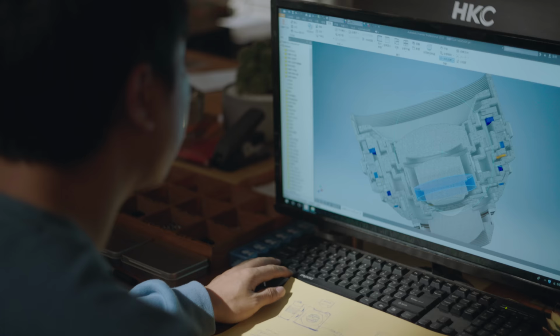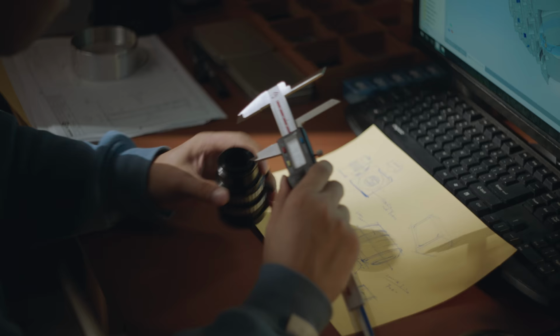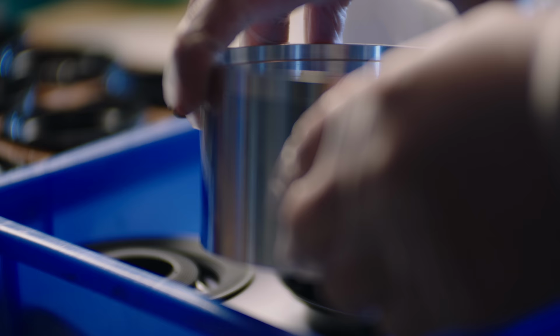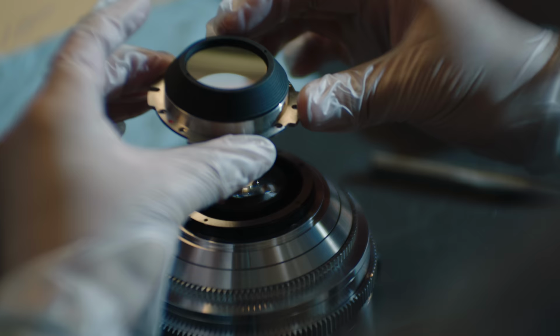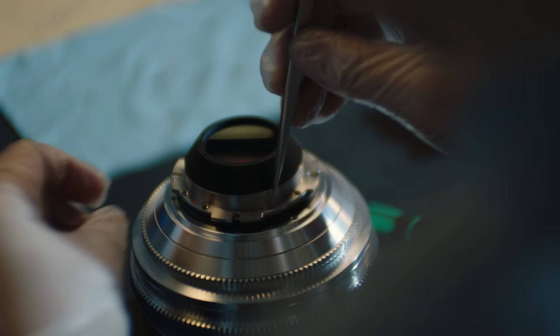While rehousers usually work with a housing system on the outside, the guts are very different depending on the brand and type of the donor lens. Every lens brand, focal length and version has its very unique design and requires individual parts. It is kind of a three-dimensional puzzle. Usually, manufacturers don't rehouse a specific lens in bulk, so they have to be manufactured and assembled one by one.